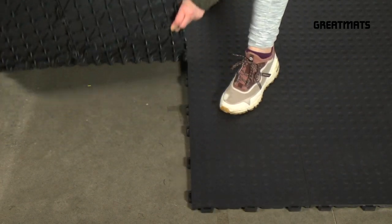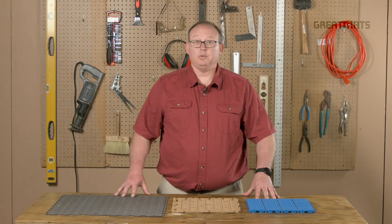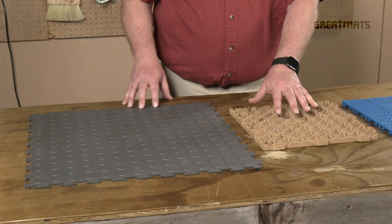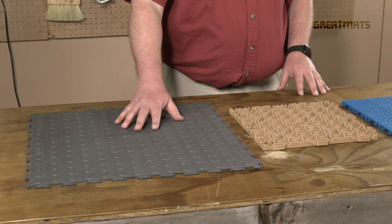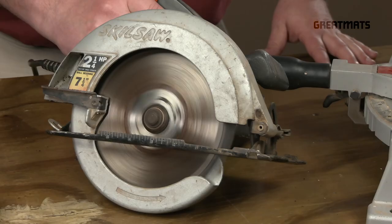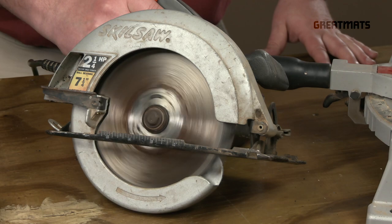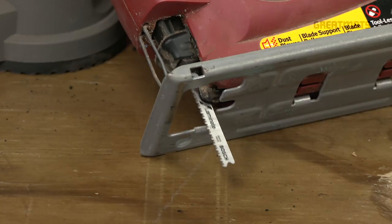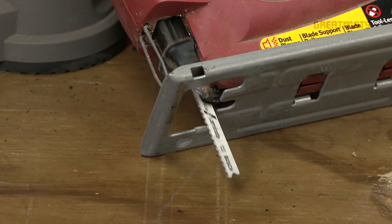The flexible nature of this type of product is the determining factor on which type of cutting device works best. PVC floor tiles are available in both a raised base and a low profile form. If you're hoping to cut these tiles using a power saw, it's best to use one where the blade travels in one direction. Those that use a reciprocating motion will cause the tiles to flex and move during cutting. The same also applies to non-powered saws and knives.